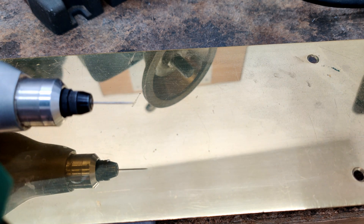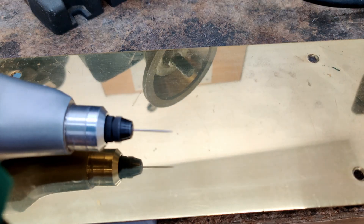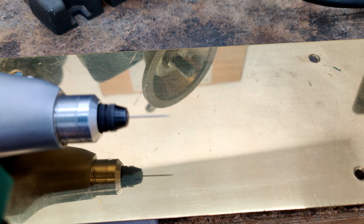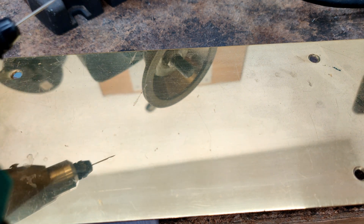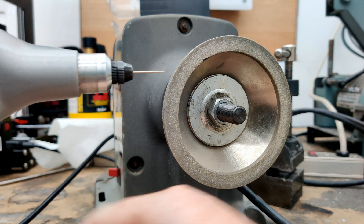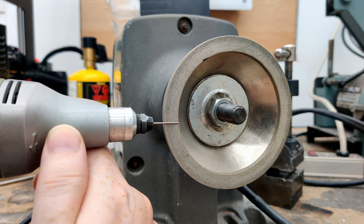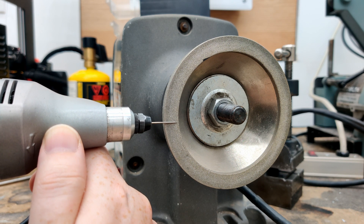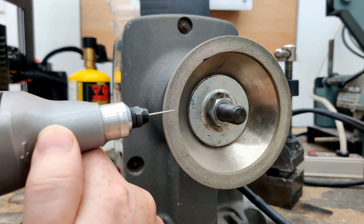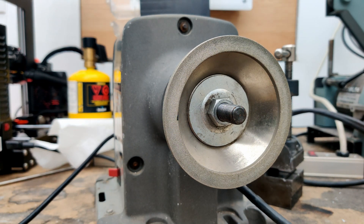The pin is now flipped around and if I give it a spin, you'll see it's not rotating very well — it's hard to tell because of the camera blur. Grinding the taper, you've got to be looking down this way and it takes a bit of time to line it up because it's a very slight angle — maybe one degree or so. You want to go easy because if you're too aggressive these wheels will just take the pin down to nothing.